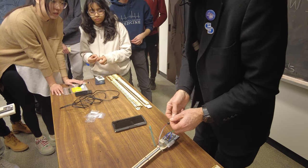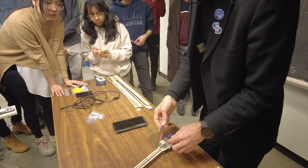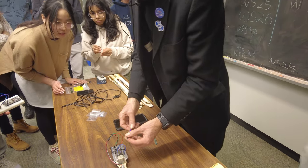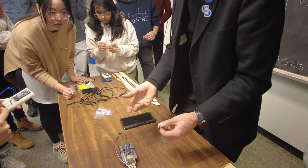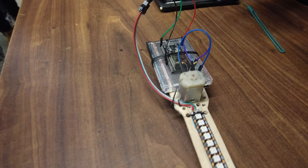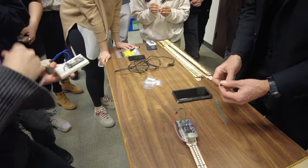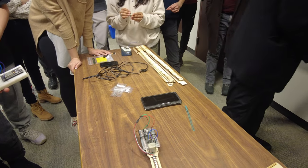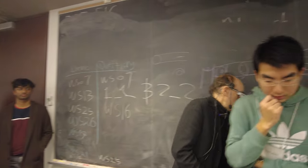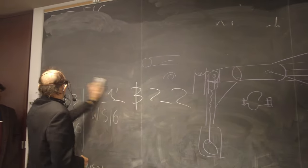Put color seven — the violet purple — into one side of the motor, and color six into the other. What I've done is arranged them so that when the motor turns counterclockwise — the positive direction of angle — it delivers a positive voltage, and when it turns clockwise — the negative direction — it generates a negative voltage.